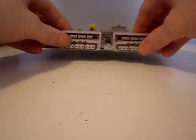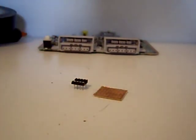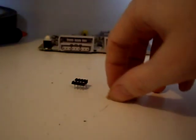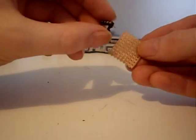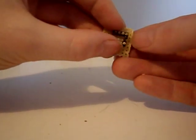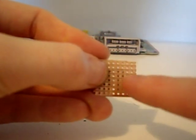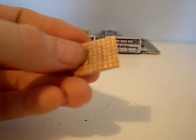Now we're going to deal with our breadboard and our chip holder. We're just going to solder that into place and cut some tracks for it. Let's place it where we would like it — place it to this side. Cut the copper tracks in between the legs so the legs don't short with one another, and we get a tool to do that with.